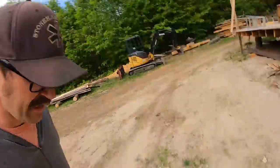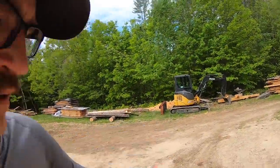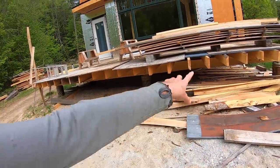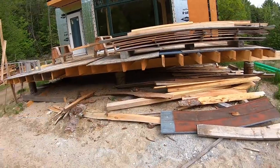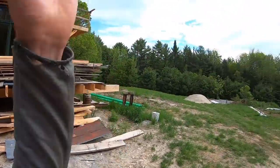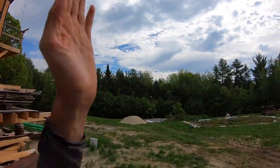Well, okay. I just got word that I've got a septic tank coming this afternoon, possibly around 2, and it's 9. And, well, there's no hole here. So I gotta make a hole with that thing there. I'm sure I'm gonna encounter some rocks, and I gotta tie into the old septic line there. So I gotta move this lumber and get this cleaned up anyway. And then bury the tank here and then run the line in a trench down to there. So here we go.